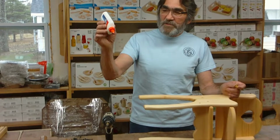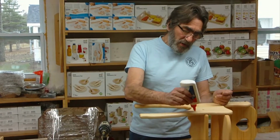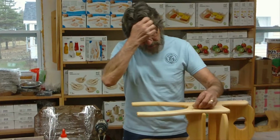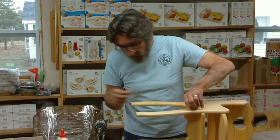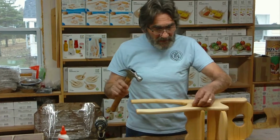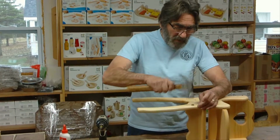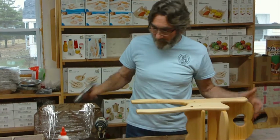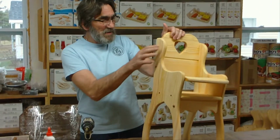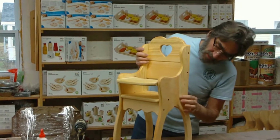So you take a little Elmer's glue or school glue, whatever. You squeeze a dab of it on the edge. Then you simply take your plug, line it up, and sometimes you may have to tap it. Tap it a little bit to get it in, like that, with a hammer. You just don't bang the thing. So you want to do all of those plugs here like this.